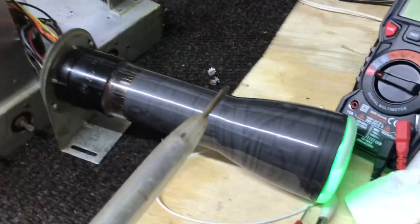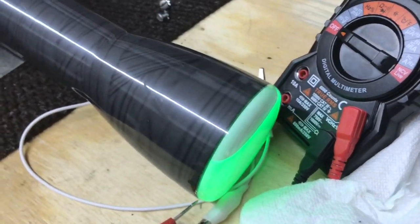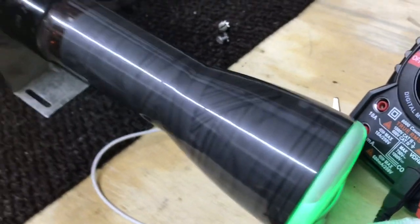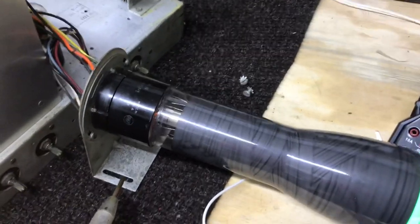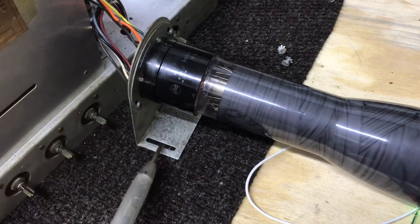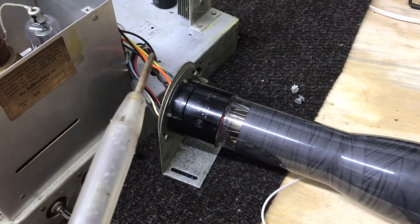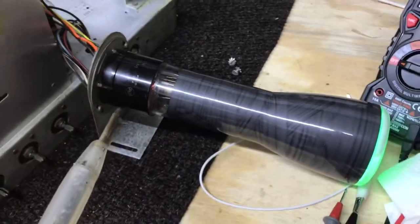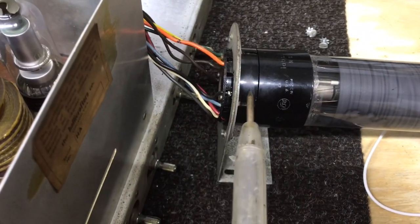Well, we've got a little problem that's developed on the Hallicrafters. Well, I still have a picture. Got my little 3-inch test tube hooked up. I noticed when I bolted this bracket down that the CRT goes in, when I would bolt it to the chassis, our high voltage would be reduced somewhat. We have some high voltage leak coming through this Bakelite socket here.